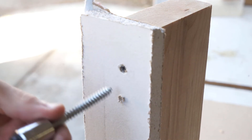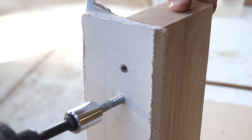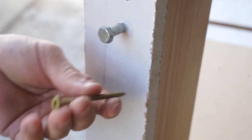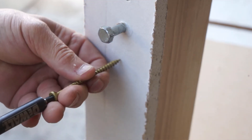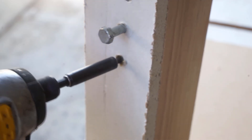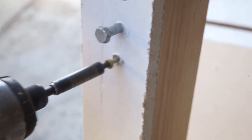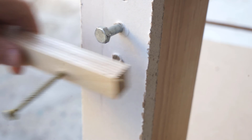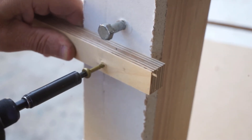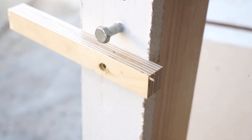When you're hanging something heavy, it's important to get your screw into a stud — and that's very strong, it is not going anywhere. You could hang something very heavy on that. These exterior wood screws are ideal as well for going into studs. They're very strong and they don't need to be pre-drilled because they pretty much drill their own hole as they go in. They're also great for holding a cleat to a wall, on which you might hang something else — even something as heavy as a cabinet or a bookshelf.